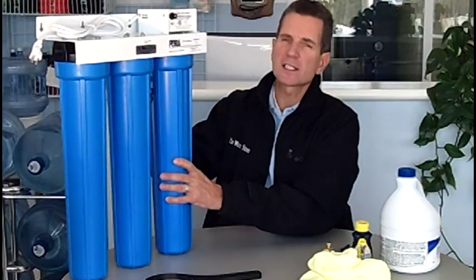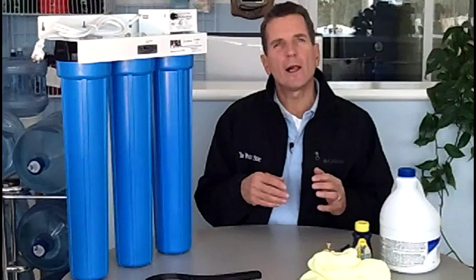Once you've done all the cold water taps, shut off your water again and go through the same process. Remove the filter housing, put two to three cups of bleach inside, tighten it back up, and go back and do all the hot water. The hot water will need to run for a little while at the first tap before you actually smell the chlorine, because in your hot water heater you've got 30 to 40 gallons of hot water already in there and that's going to dilute the chlorine — it may take a while before you get that residual at the first tap.